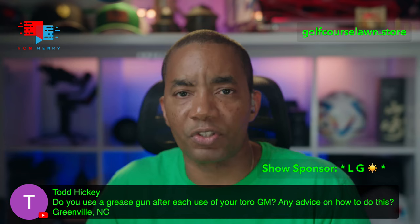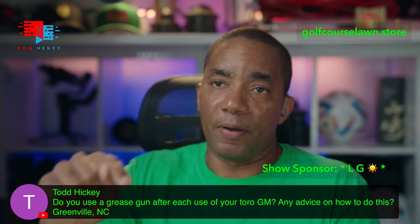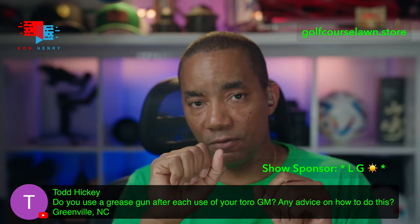I do it once a month. Once a month, I will hit it. So I'll tell you, there is a fitting, and I don't know the actual name, but there's like a gearbox, or probably it's not really gears in there. So the way the rear drum is propelled, there is a set of pulleys that come from the engine and that go to this axle that's along the back, right? On that, there is a grease fitting there. So I hit that grease fitting, the grease fitting that is for